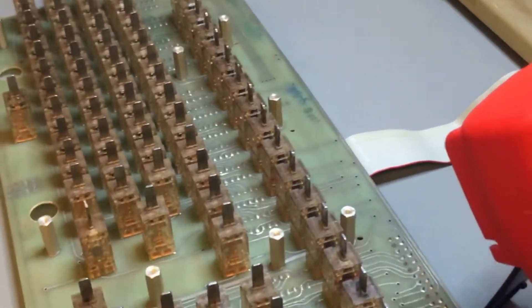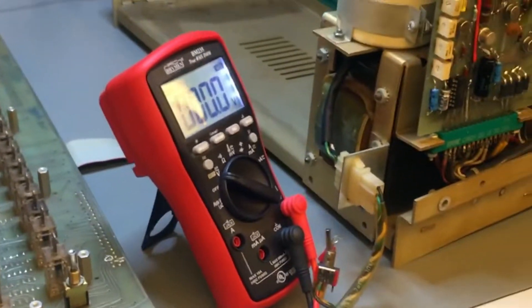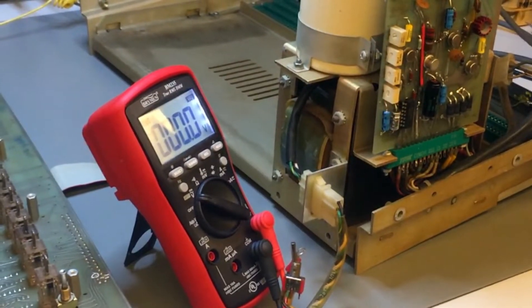I've changed the incandescent lights on the side of the keyboard, and here I'm just showing you where the keyboard controller fits. We restored this controller board in part three, the previous episode. That's where it fits — right underneath the key switches. Then it's connected via that ribbon cable to the rest of the system; it goes into the backplane board.